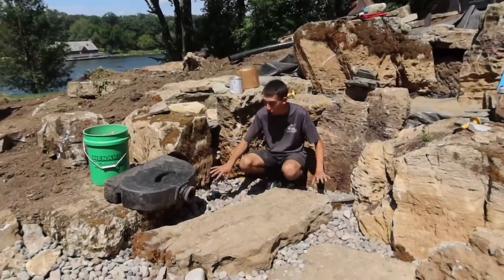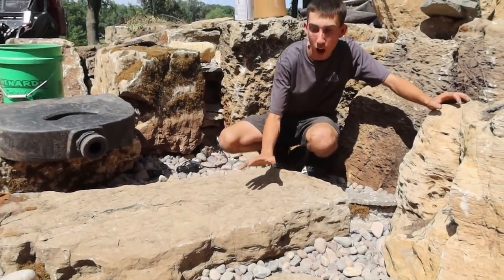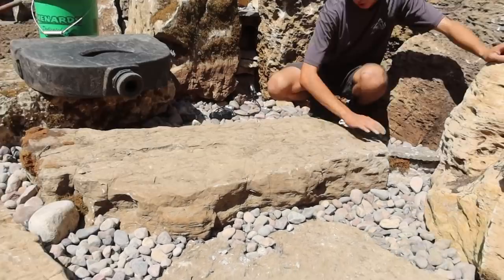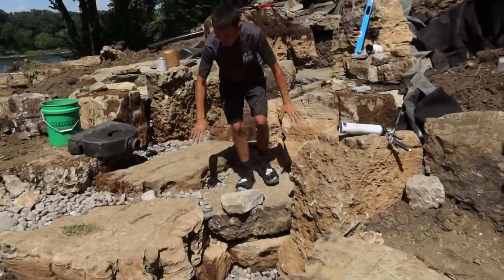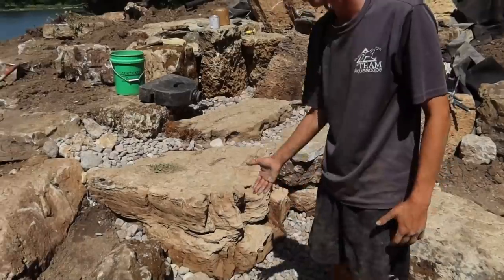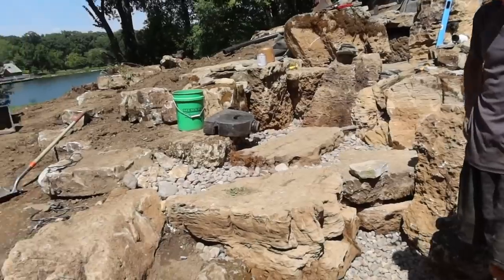All three of these falls are going to drop in this pooling area. We're going to get a nice waterfall coming up here, allowing this water to dam out back here and pull up on this rock — making a weeping wall effect all across this rock. It's not going to go over because we have it all foamed up, but that rock is slightly higher at that point than this one. Water will come all across this rock, fall into this pooling area, come across this next rock, and drop into our basin. We like to carry that water across our basin via what we call a bib liner, pretty much halfway or three-quarters across, to give the illusion of water carving out between the rock instead of just falling right into the basin.